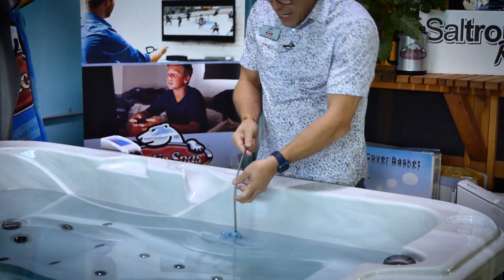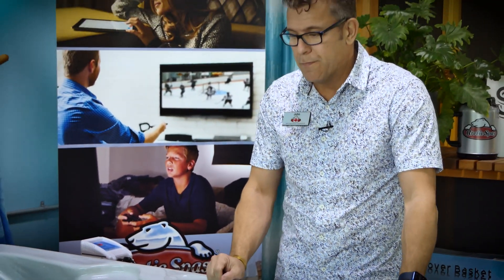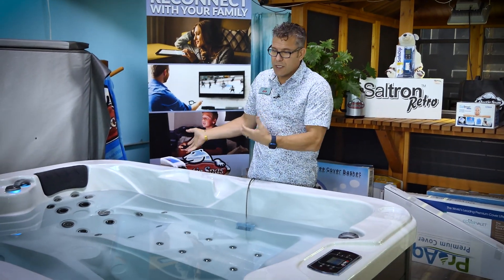This piece hanging in here is actually the electrode, and what I'm going to do is explain basically how this system works. When we get the water in a spa, we have to purify it on a regular basis because we're not draining and filling it every time like you would a bathtub. Normally on spas we'd use a granular chlorine, a liquid chlorine, or perhaps a slow-dissolving puck in a tablet dispenser. The big difference with this type of system is when you first fill it up, we dissolve a certain amount of salt in the water depending on the volume, so that we can get a concentration of between 2,000 and 3,000 parts per million.